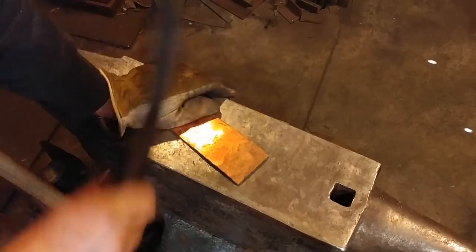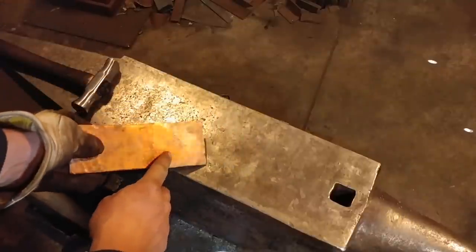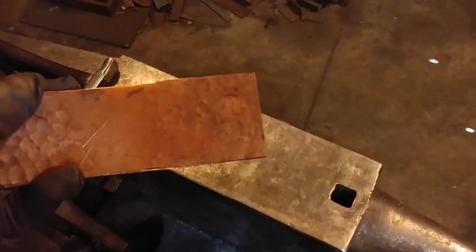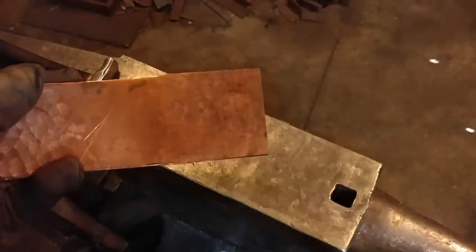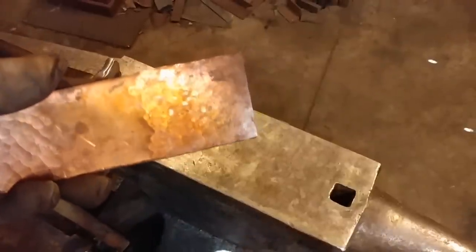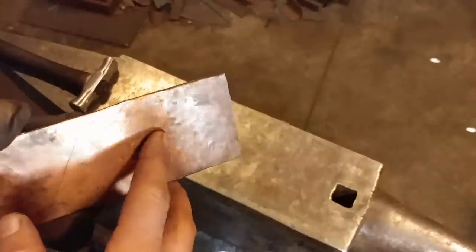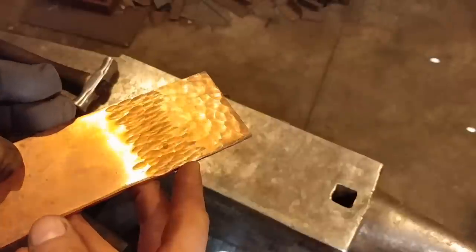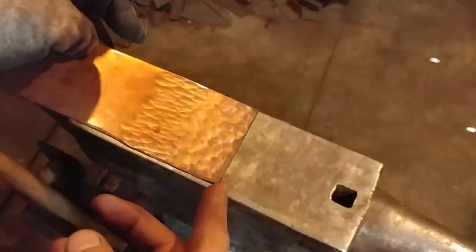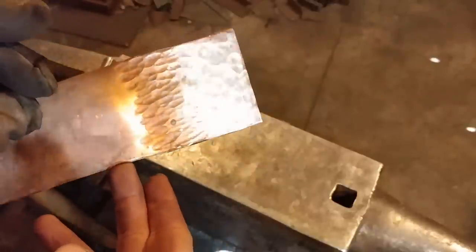Here you can see the texture off my anvil surface — it's fairly clean but still has its problems. I'm adjusting the camera to lighten it up so you can see what's going on. You can see there's a rougher texture on the back side; when I flip it over you'll see the front side and the difference. See that glint and shininess — that's what we want to preserve with a nice clean hammer blow. There are the two peens working in conjunction: the hammer face to the right and the peen to the left.